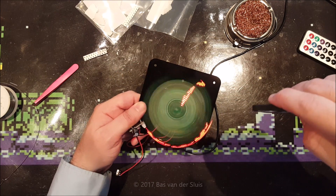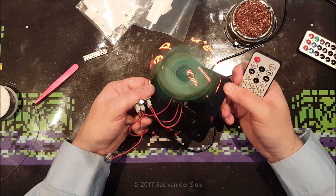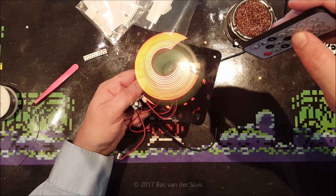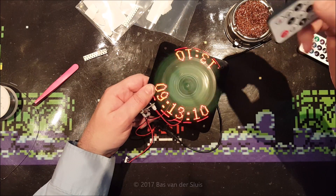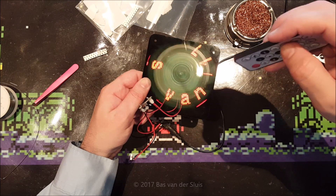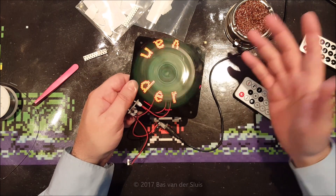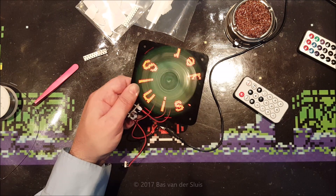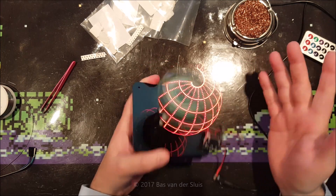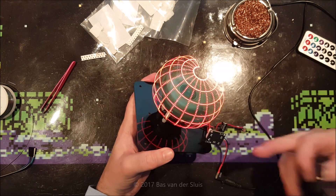It's not going into error mode anymore - it is responsive and stays responsive. The time works, the text works. Or maybe that's just because I haven't uploaded enough images? That could be it - I'm going to reprogram this and see if it can hold a large number of images. And that was actually the problem: I had not loaded enough images. Now I've loaded this image - I like it a lot - and I can pause and play it. Not having enough images was causing it to keep restarting over and over again back to text mode.